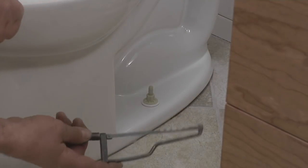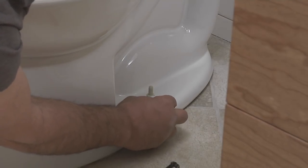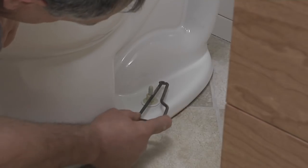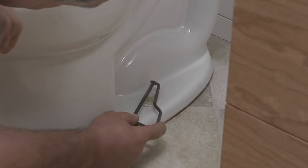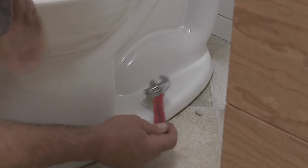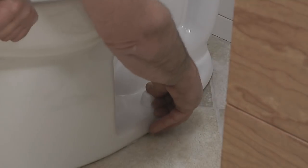So we're coming down to the end here, but we want to finish off by cutting these bolts and installing the finished cap that hides the bolt and the nut. I've already done the left side, so now I'm going to cut here. And I'm using the top of the nut as the guide for my saw blade, because I want to snug that bolt when I'm done, just to make sure we've got it as tight as we want it. And that actually feels real good right there. We're done. Going to wipe a few crumbs away here, and next we're going to pop on the cap.